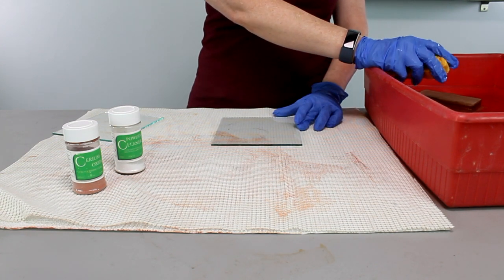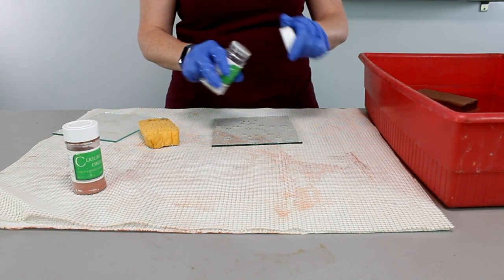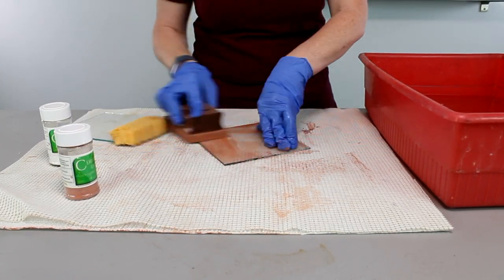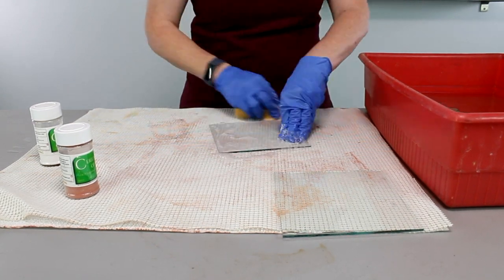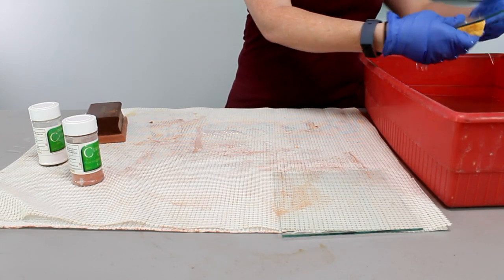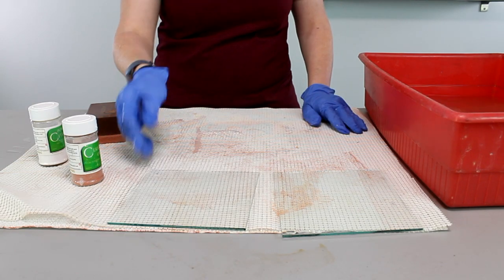As we always do, we're going to start off our process of mirroring with cleaning the glass. We're chemically cleaning it, which is a very important step in the mirroring process — making sure your piece is completely clean. We're doing this with powdered glass cleaner and then going behind it with cerium oxide. The cerium oxide is an additional polishing process, and you can see we're polishing that glass with our maple felt polisher. With the cerium oxide, we do need to physically wipe that off the surface, using a nice soft sponge to make sure any cerium oxide left on the surface has been wiped off.